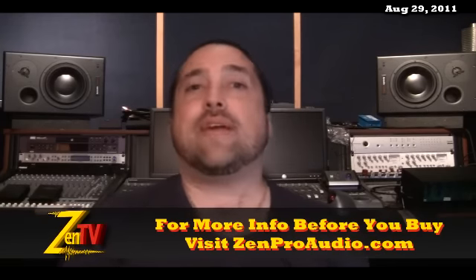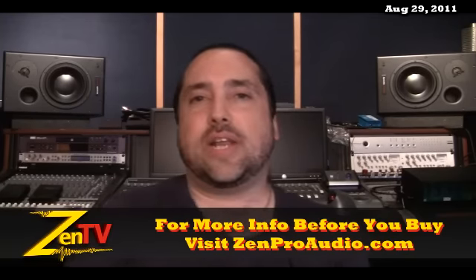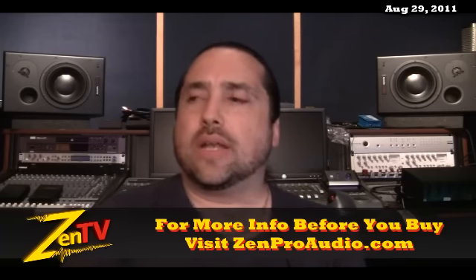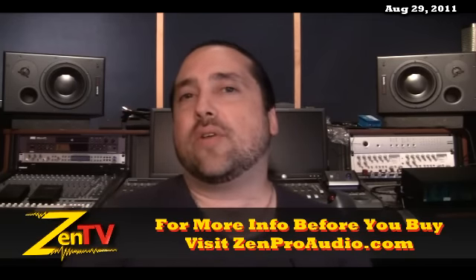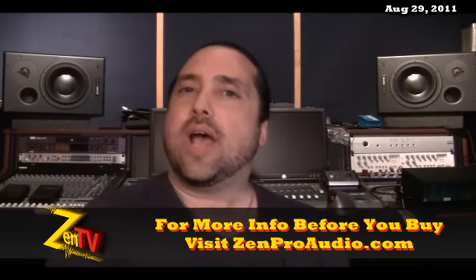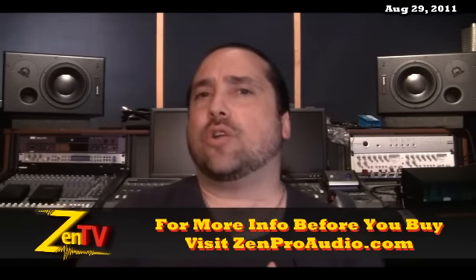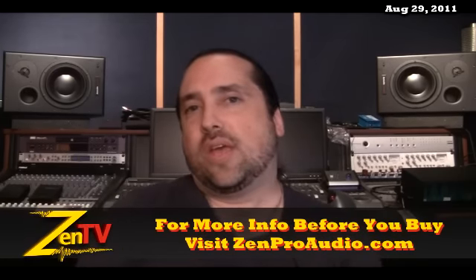Chameleon Labs just started shipping. We have them here now, also tested and in the Clipolator. They're the 581 — a 500 series 1081 clone mic pre. They've got a mod called the iMod, and we wanted to wait until the units came in to make sure that we could do it ourselves and that there was room to work in, and there is. We are using the exact same Carnhill transformer and replacing it here at Zen Pro with an introductory price of $100, bringing the entire cost of the unit to $499 out the door. We have tested it in the Clipolator stock and fully modified so that you can hear the differences — they're subtle, like all transformer swaps are, but it's there. It's got that added clarity and a little bit more of that punch and sort of width to things as well.